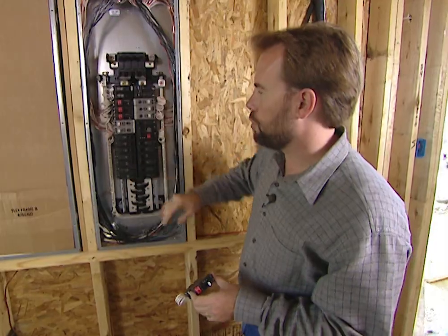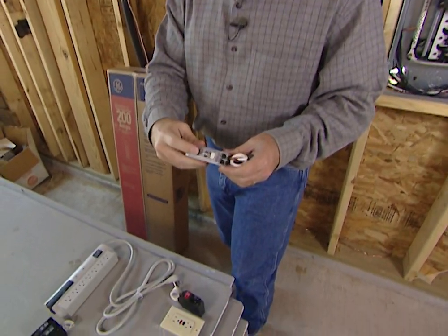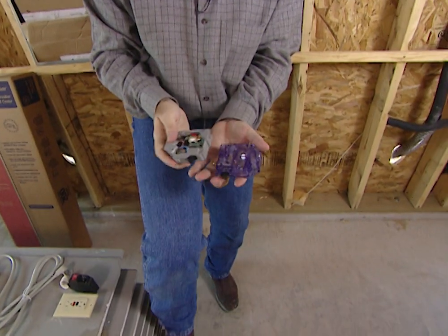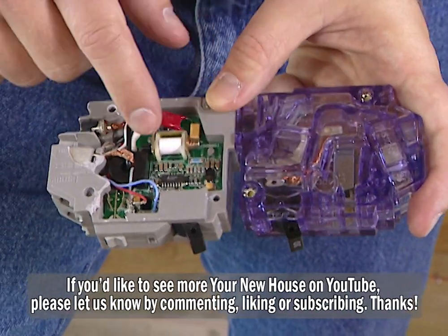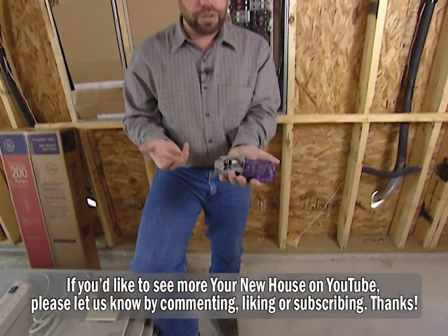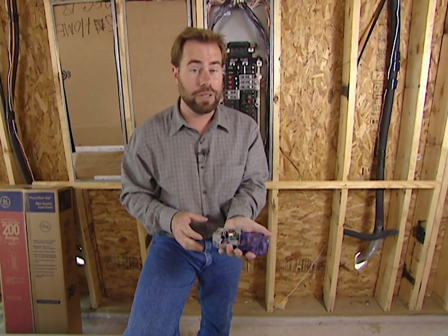The black ones are normal circuit breakers. The gray ones are arc fault circuit interrupters, and they look fairly similar to standard breakers unless you put them side by side. We've cut the top off one here — this is the arc fault circuit interrupter, this is a normal circuit breaker. The normal one is mechanically controlled, while the arc fault one has a computer board mounted inside it. You're always going to get small arcs when motors crank up in appliances, but this computer board can distinguish between a normal arc and one that's a real problem that could start a fire.